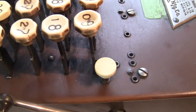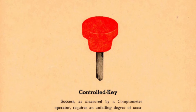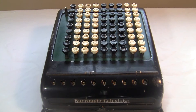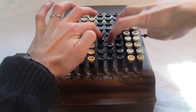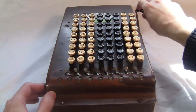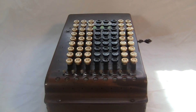At the top of the machine is this little guy — usually this key was red. This is called the controlled key mechanism. This was a killer feature that the Burroughs machines never had. On this type of machine, a partial key press will register the wrong number. Look at what happens on the Burroughs calculator if I hit the 9 but don't push it all the way. Unfortunately, when you're doing lots of key presses really fast, it's pretty easy to do a partial press without even noticing — and that's the problem: the not noticing. Making a mistake isn't a big deal if you know it happened; you just start over again. But if you didn't know it happened, then you'll get the wrong answer and think it's right.